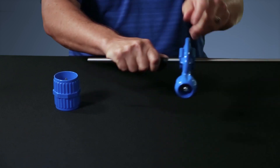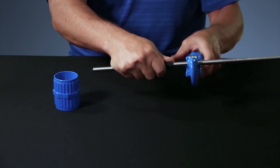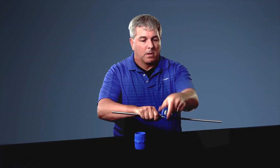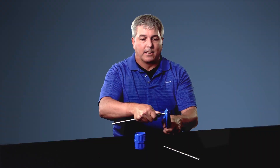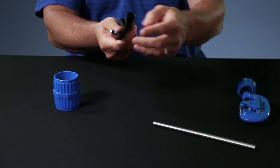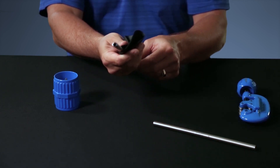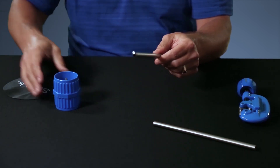It really depends on the blade and if it's in good shape. But once you cut through, you'll be able to hear it and feel it. You'll notice that we've moved the material from the OD of the tubing into the ID, and we're going to need to remove those burrs by using the Swagelok deburring tool.